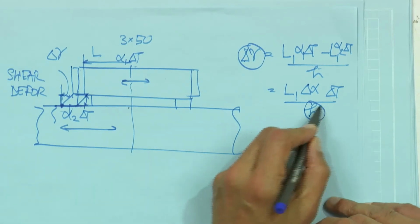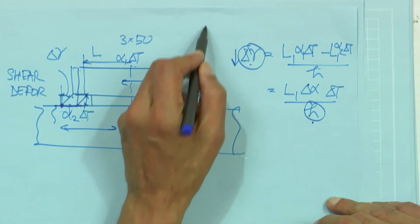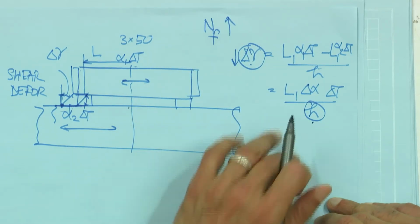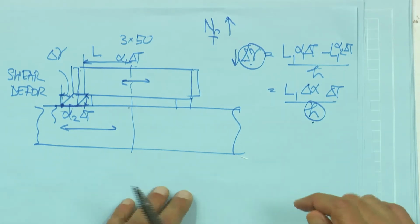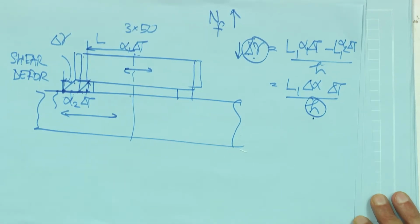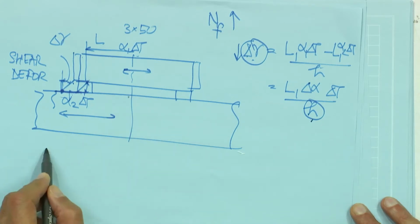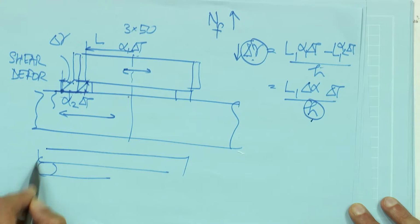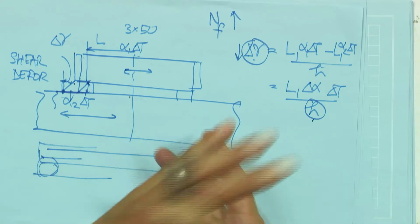Okay? So if I make the solder joint taller, I can make the shear strain go down, therefore fatigue life, that's Nf, which stands for cycles to failure, will go up. We'll talk much more about fatigue life in day 5, unfortunately not yet. But I just want to explain where the ceramic column grid array is coming from. So think about the ball grid array now. What we would like to do is make these joints taller, right? The problem is it's a sphere. How do you make a sphere taller?